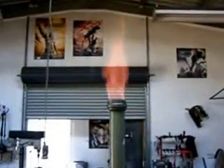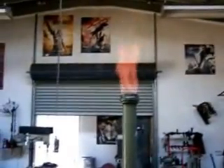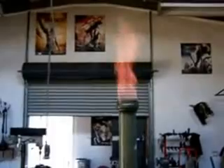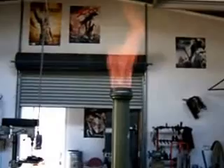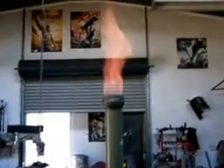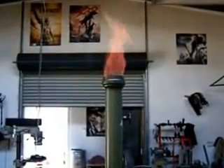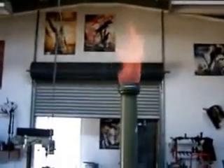Back again — I've just thrown it through the filters. I'm still experimenting with filter material. The next thing I'm probably going to try is steel wool. At the moment I'm using pillow stuffing, which is a synthetic substance — just ripping it apart and stuffing it into the filter cans. The flame has obviously cracked tar; there's no yellow in it, but I did have a much bluer flame earlier on. I don't think the filters are fully up to this task yet. I'll just turn that modulator down a little bit and show you quickly how the vibrator works when I flick it on.